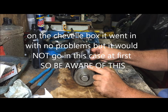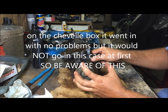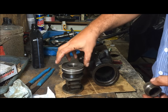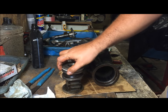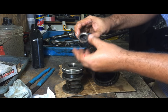If you can't get this in there, take the O-ring out carefully, and just put this in there and just let it sit in that case, and it'll get used to being in that space. Okay, so now that you've got this where it goes in and out easy, comfortably, and it's seated in there the way it's supposed to with the new O-ring and then the Teflon seal,